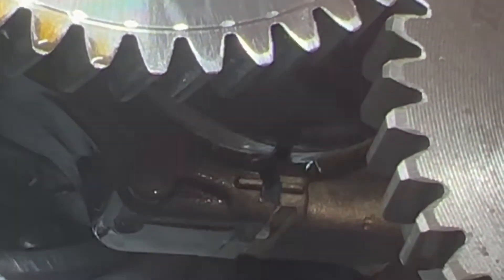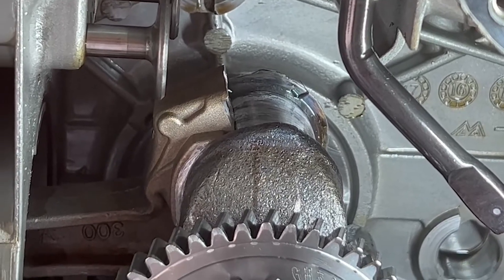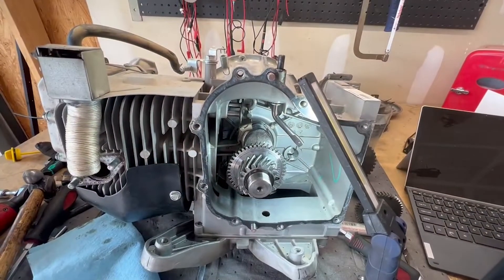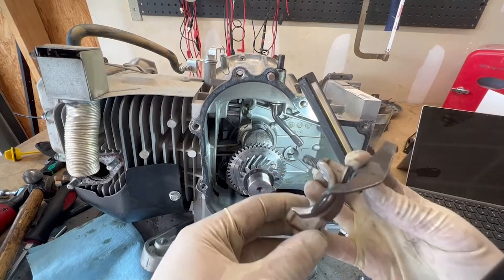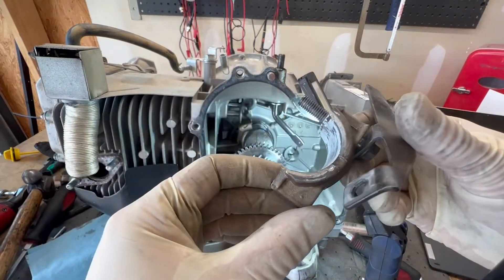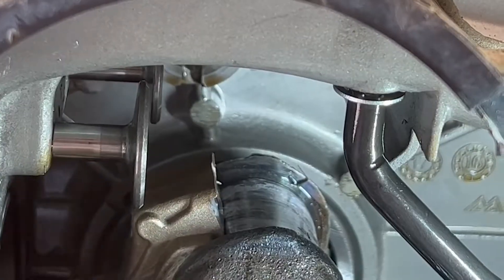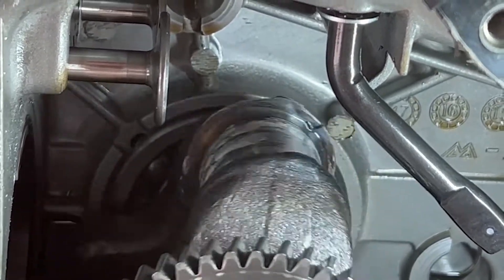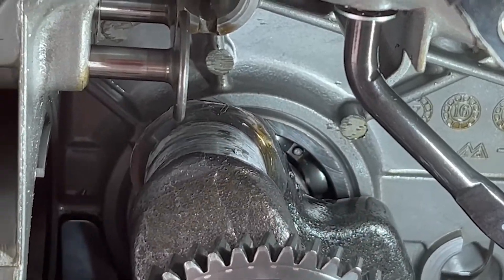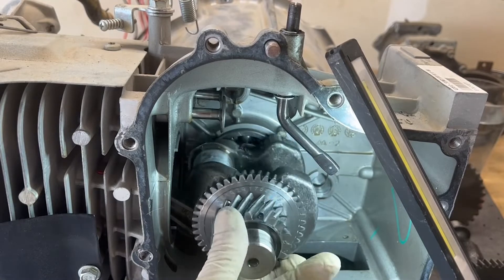Something — the bearing failed — and that's what we're all bound up on. It's the bearing. I was able to get the cam and the other counterbalance out. This is our bearing surface — just smoked. This is our oil pump. You can see that this crank got smoked too, but everything else looks fine — the teeth look fine. This bearing doesn't seem to be compromised.